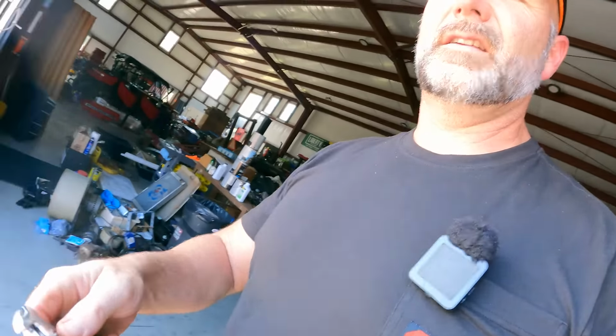It spins clockwise? I believe it's clockwise. I don't know. I think it spins clockwise, but it kicks it out. You gotta figure out which way it spins. So when you first get this machine, raise it up ever so slightly, bump it slightly, not to where you can see the blades, but be careful and make sure you're turning it in the right direction. You can mess up and turn it in the wrong direction.